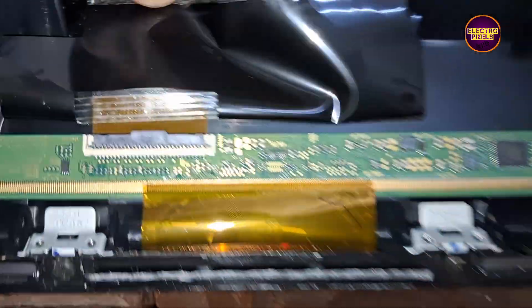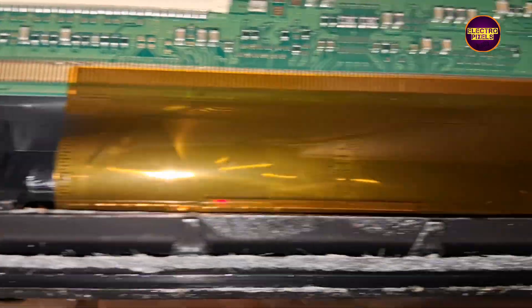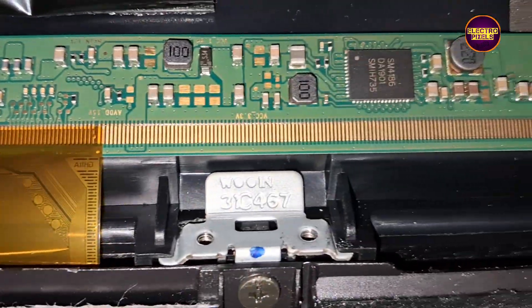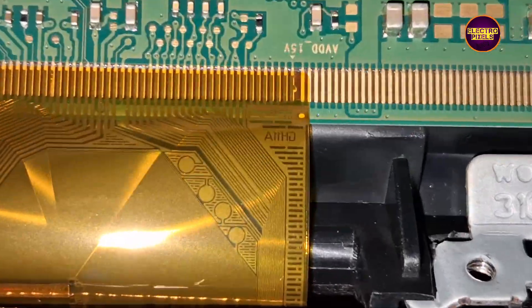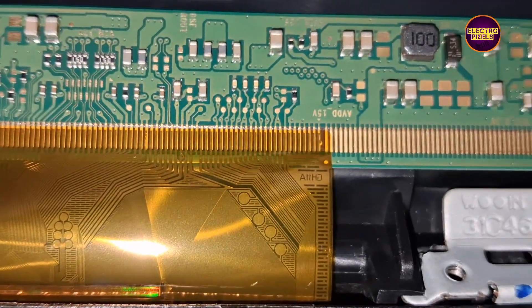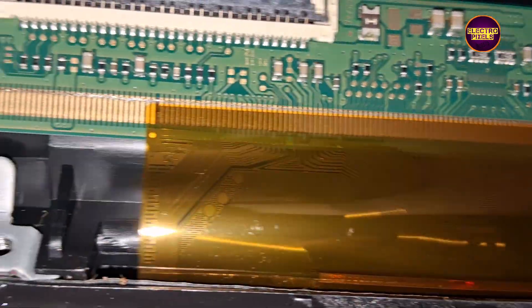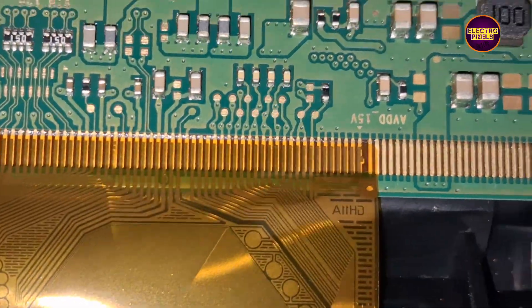This TV comes with a single CoF Samsung panel with SM4186 DC-DC IC. Due to internal shorting in gate signals, this IC goes into protection mode, and because of that it doesn't generate any basic panel voltages. If the shorting is on any one side of the panel, then we can simply repair this TV.